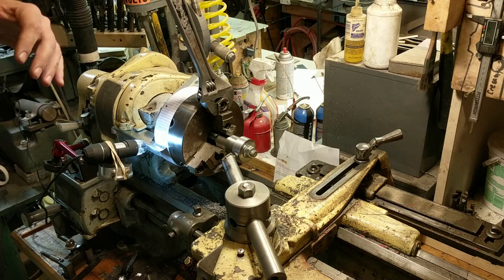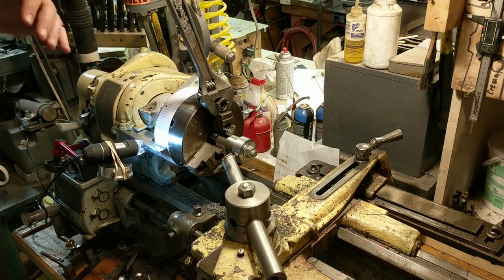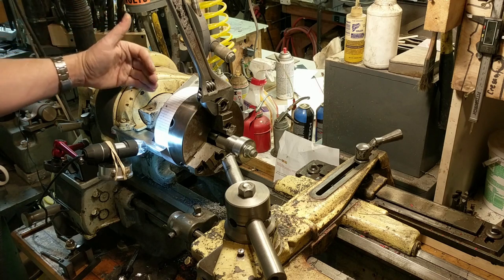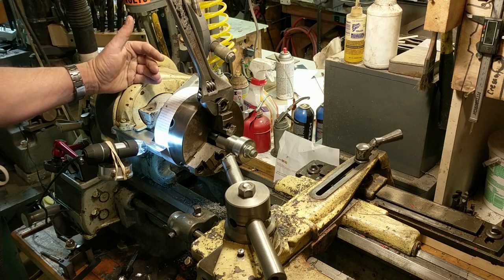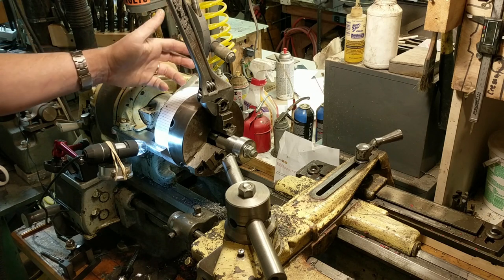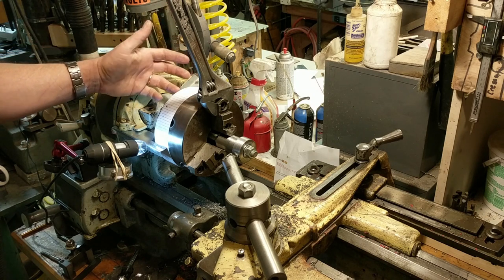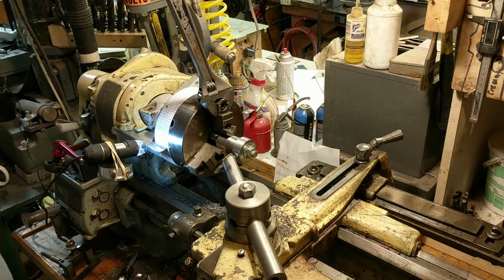Using this setup does take a little longer than if I had something mechanical — like Mr. Pete, who just uses a saw blade and click-click-click, which is really fast. This is a little slower because for each line I have to manually adjust to the line. But the cool part is it's pretty much infinitely adjustable: as long as you can print out the tape with the indexing marks you need, you can index any number. That's the tip — let me know in the comments if you have any additional input, and thanks for watching.